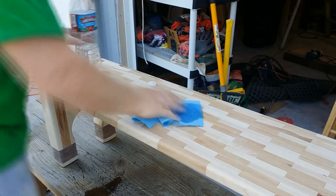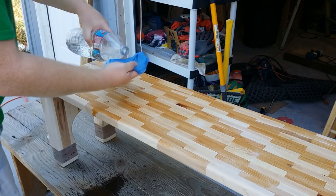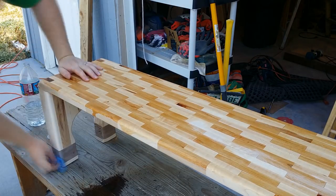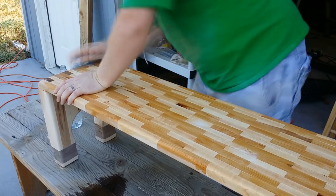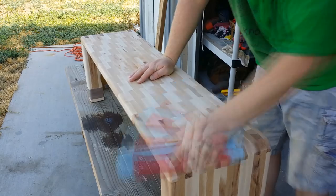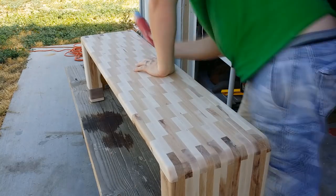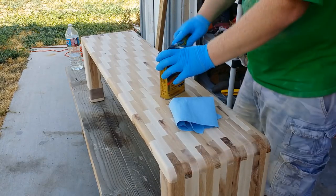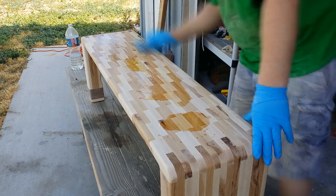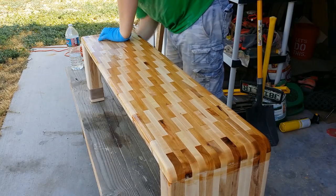We're getting to the end here and we can start seeing the design really pop. I just love that segmented look. I'm raising the grain so I can knock it down with some 320-grit sandpaper. I definitely learned a lot in this build, hopefully I remember it while I'm busy throwing things around in my shop. Let's throw on some wipe-on-poly — the whole project used that entire bottle. I put on three or four coats, or just until it was gone, sanding in between each. And this has got to be one of my favorite projects I've made.